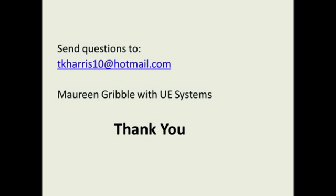Yeah, that's a good question. It comes up a lot, and that's why I start all my customers off filtering at 10 micron beta 1000. Then a lot of my customers, after a few years, after they get their lubrication excellence program up and running, they filter down to 5 microns beta 1000. I've got a few that went down to 3, but there's no danger in filtering out any additives till you get down around 1 micron, which I don't recommend going there.